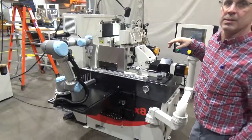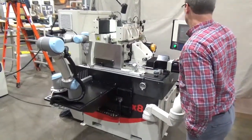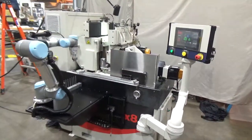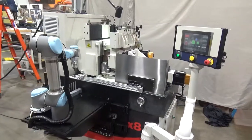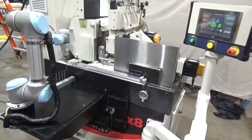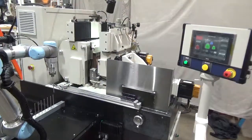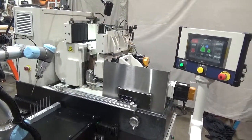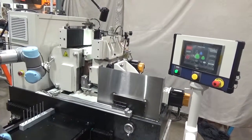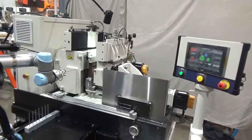This is the Rollmaster centerless grinder model TG-12x8. The TG-12x8 is capable of infeed and through-feed grinding diameters up to 3 inches. This machine has a ram bed position control using a ball screw and servo motor. The dial indicator shows fine position movements, while the on-screen digital display reports relative position from a previous set point.